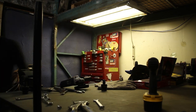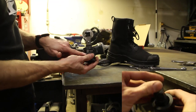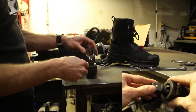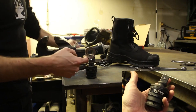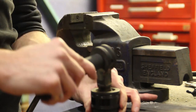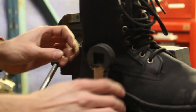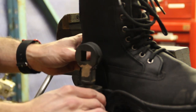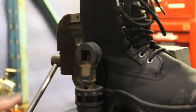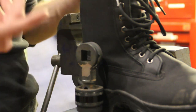Let's take a look at what I've done. This is what I've welded together — I've basically taken one of the three-quarter inch universal adapters and welded a socket adapter on top. The leg will actually attach here, so you'll have your leg attaching like that, going up, with all this flexibility. This piece will be attached to a weldment which attaches to the boots, putting this right at your ankle joint. You'll put these boots on, strap the exoskeleton legs in, insert a little cotter pin to hold them in place, and boom — you're ready to go.